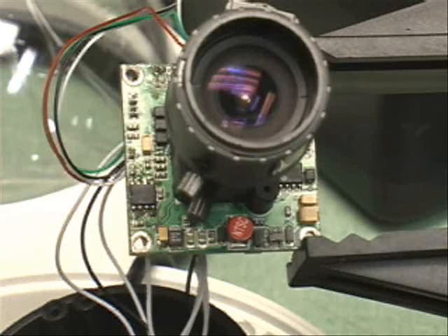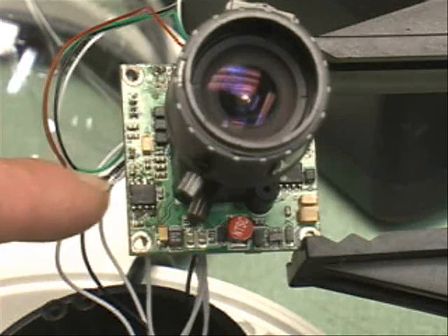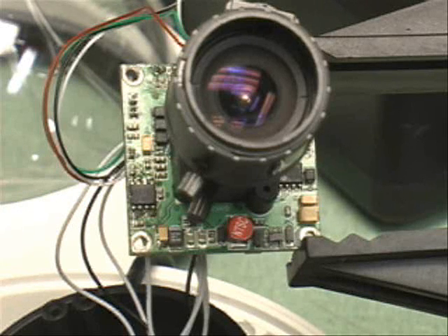Initially, after poking around blindly — I don't have the schematic for this — I decided to take some waveforms but came to the conclusion that it was going to be meaningless without the schematic. So I went with taking voltages and noticed that voltages on this chip would fluctuate as the loss of sync would start happening. I also tried freeze spray on the components, but the limitation was very obvious because the components are in very close proximity to each other — freeze spray one and chances are you're going to freeze spray the others too, so you can't really pinpoint which component is causing the problem.